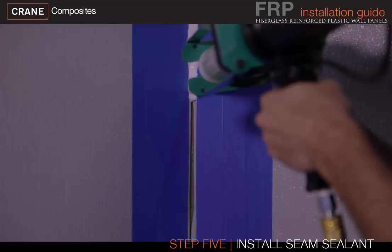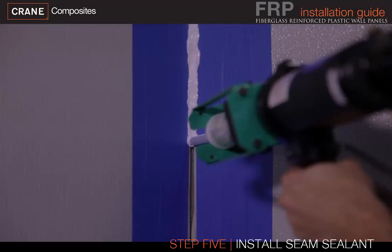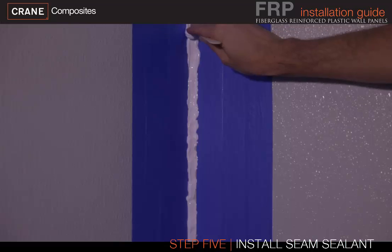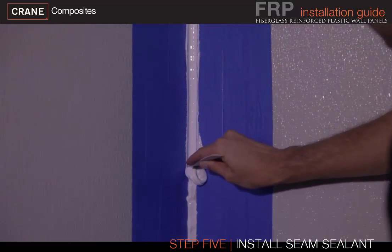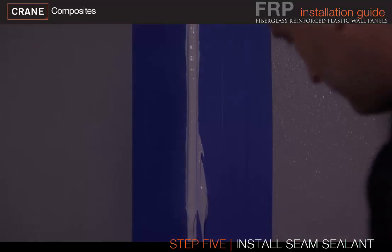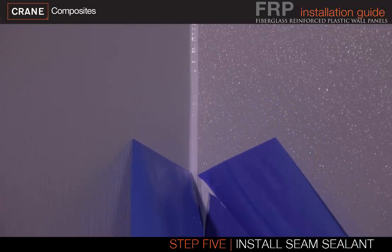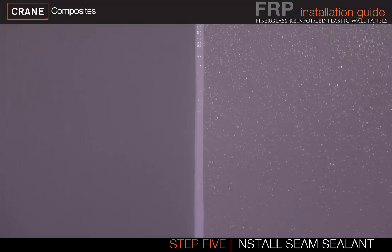All vertical seams should be processed first, and the seams need to be completely filled. After the sealant is dispensed, smooth the sealant flush with the panel's surface — smoothing must occur within the open time of the sealant. Remove the painter's tape from the panels and remove any excess sealant on panels with a solvent-dampened rag. Inside corners are done similarly to the vertical seam; use a radial finisher tool to round the corner joints.